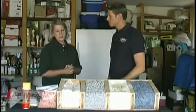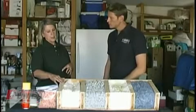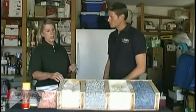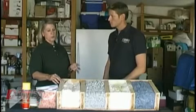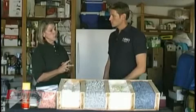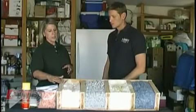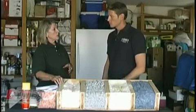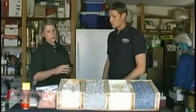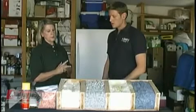Well, typically, if you have a joist up in the attic and you have fiberglass batt, that's going to be a 12-inch cavity typically, and at an R 3.2 per inch, you're going to have probably your R38 minimum insulation in that cavity. The thing that you need to look out for is to make sure that your joists are covered with insulation, because that's a heat sink, and through thermal bridging you can lose heat. So you want to make sure that you have something enough over that.